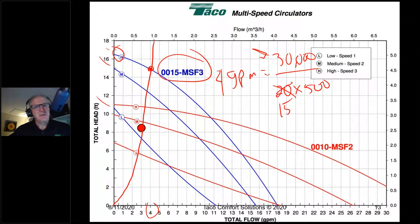What's that going to do to the boiler? I'll give you a hint. It's short cycling. Okay, we're going to short cycle the boiler. We're going to force that boiler to short cycle more than it wants to already, on the day where its cycle should be the longest. And here's the kicker: as it gets warmer, this situation gets worse. Let's say I'm at 50% load. That's 15,000 BTUs. Now my delta T isn't 15, my delta T is 7.5 degrees,